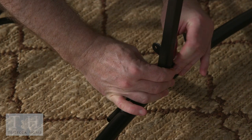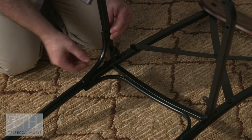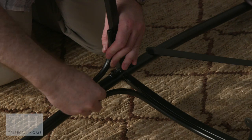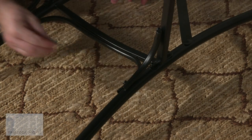Connect the supporters with bolts to the seat frame and back leg. Make sure the tabs are on the inside of the chair — the flat tab attaches to the seat frame and the curved tab attaches to the leg. Use the Allen wrench if you need help turning these bolts.